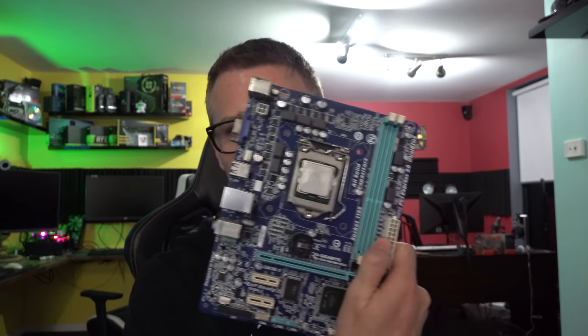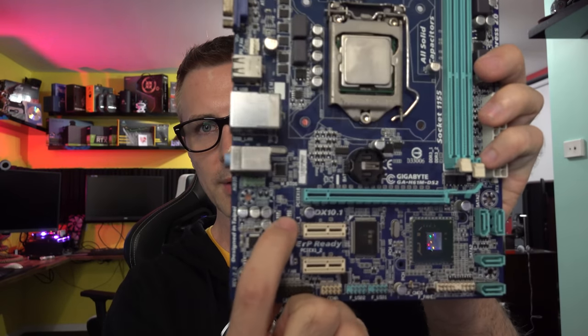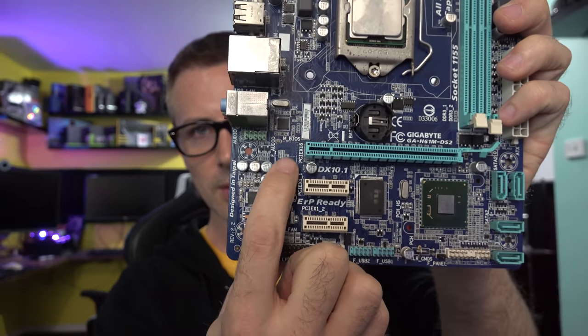So now we're finished up with the last three motherboards, and the Gigabyte was the most interesting of the boards because this one can work, except it's going to need a BIOS where the main BIOS chip actually is, because it's currently missing. When I enacted the backup BIOS to flash to the main BIOS, that's when I realized, oh, this isn't working, what's going on? And then I saw there was no main BIOS there. So I believe this motherboard could work if there was a main BIOS soldered back onto it. Now, I actually don't have the tools to do that in my studio here, so I will keep this motherboard around because I think it can come back to life.